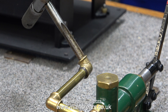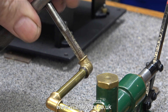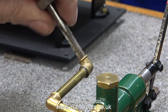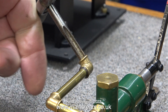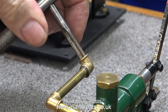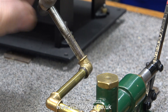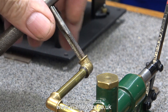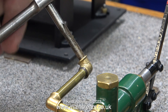I've moved the steam plant up into the main workshop because I need to do things that I can't do in the workshop attached to the house. What I'm currently doing is re-threading a PM Research elbow because the American Q40 standard and the English Q40 standard is slightly different. I'm running a Q40 plug tap down into the elbow which will put this matter right, because this is an English Q40 plug tap.